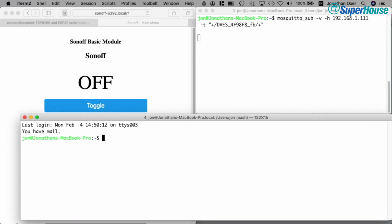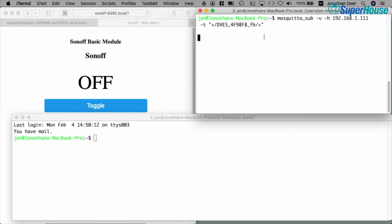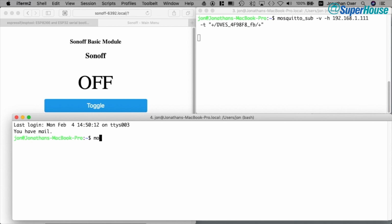I want to be able to see the topics we've subscribed to up here on the right. We can see the Sonoff web interface in the background. And now we can publish commands and have them sent to the Sonoff. And we'll send it to that same MQTT broker. And the topic we're going to publish to is CMND for command, and then that fallback address, and then power, which is the particular attribute that we want to control. And the message we want to send is on.